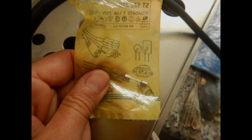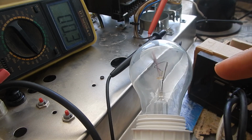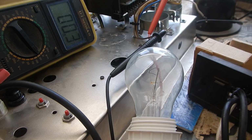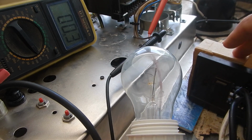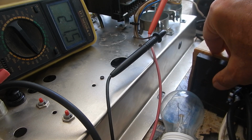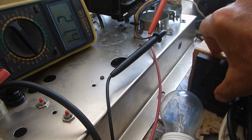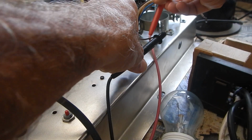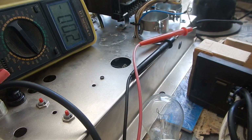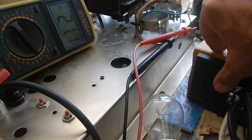So, it is time to try to apply power again and hope this last fuse has a longer life than its other siblings. Since I don't want to risk any new short circuit, I'll first use a series bulb. If it stays off, it means there is no short anymore. Okay, no short circuit and the positive rectifier output shows a good voltage. Let's also measure the negative output. It is okay too, so far so good.